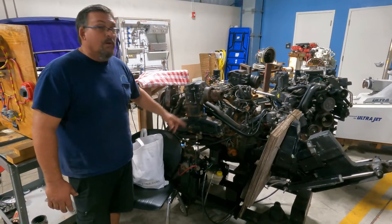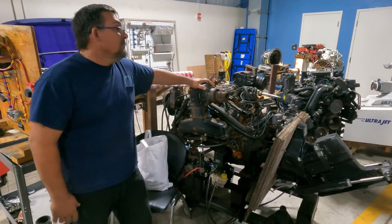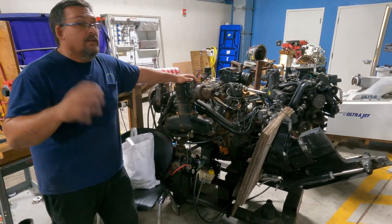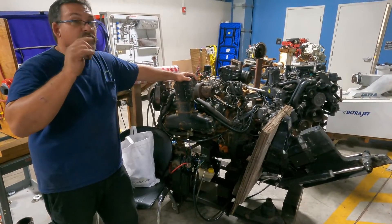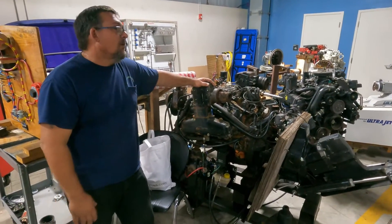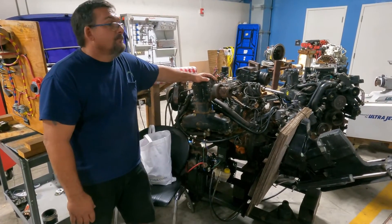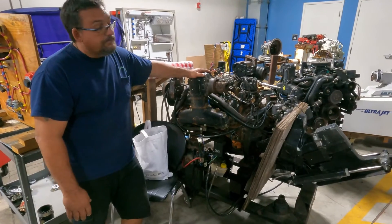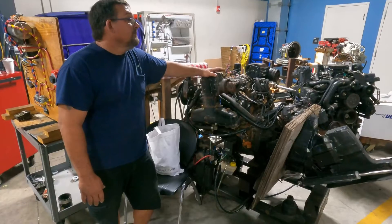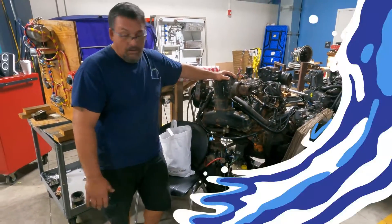If you see water leaking on the outside, it's more likely leaking on the inside too — this is what you call the silent killer. When the engine is running you won't feel it unless it's a really bad case. But if you shut the boat down and an exhaust valve stays stuck open, water loads up in the cylinders. The next day you go to start it — clunk — and it's done. That's why every three to five years you replace these. There are also newer versions now that have a catalyst in them.